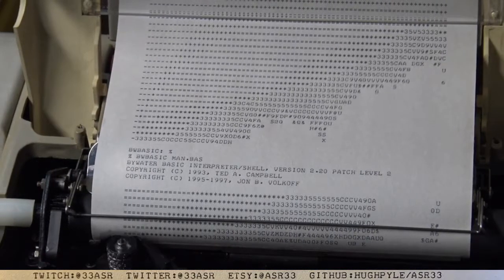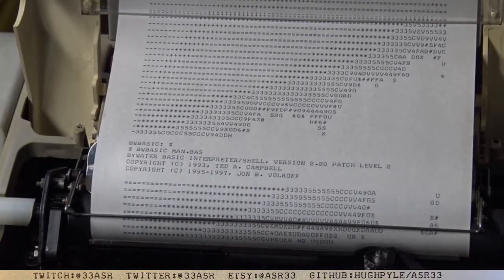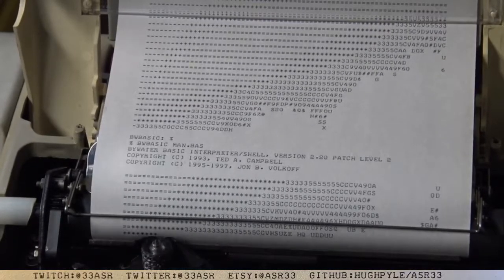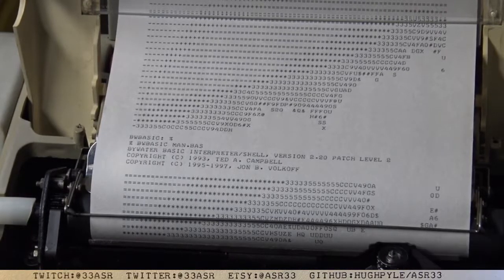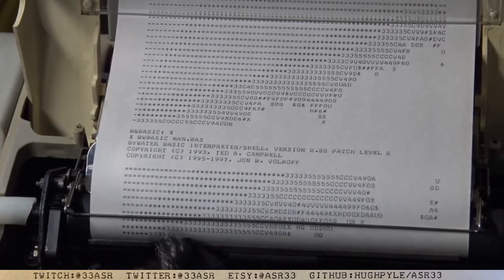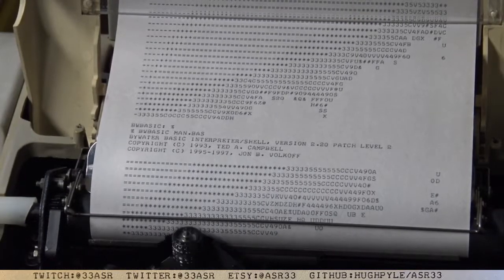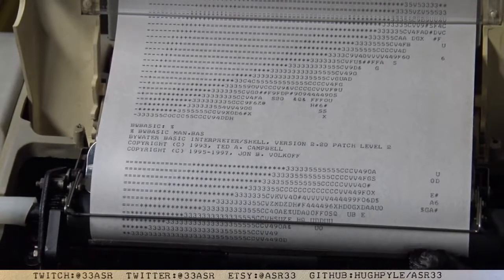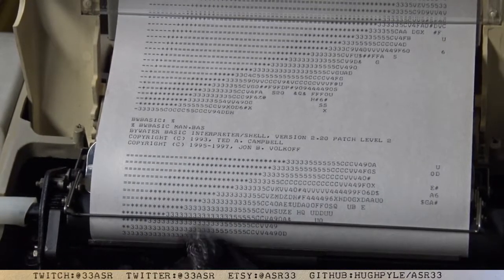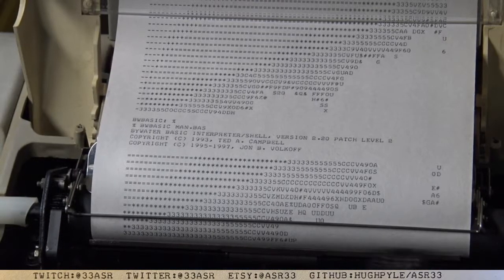Yeah, so other things about editing on it. It doesn't have backspace. There's no physical backspace in the mechanism. And so you can simulate backspace by rewinding to the start of the line, then counting how many spaces and spacing forward. I've done that in firmware on a Teensy microprocessor. Yeah, most typewriters do, because you really want to use them pretty often if you're interactive.